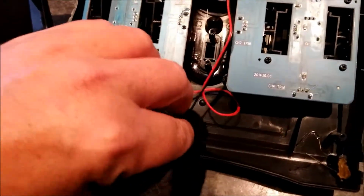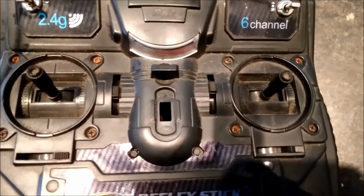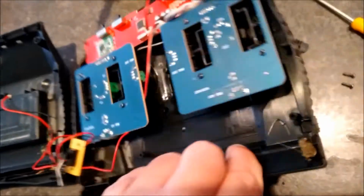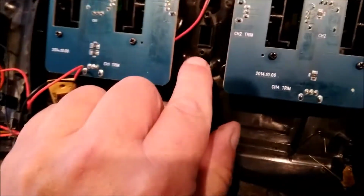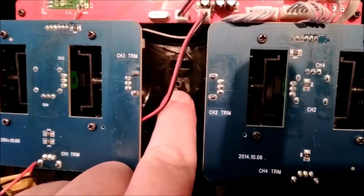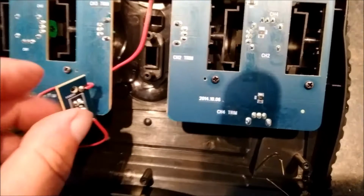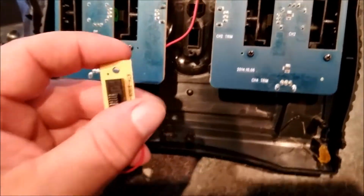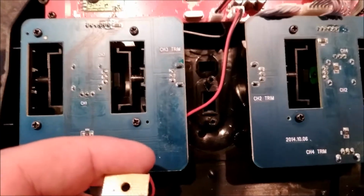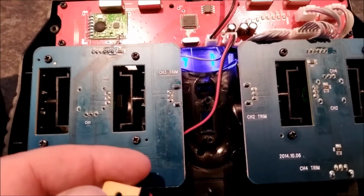So I sprayed the switch from the front side of the remote control unit, just there, and then I unscrewed 2 screws, one there, one just above it there, and that released the power switch, and I gave that a spray as well. And now when we turn the power switch on, you should see a blue light coming on. And there it is.